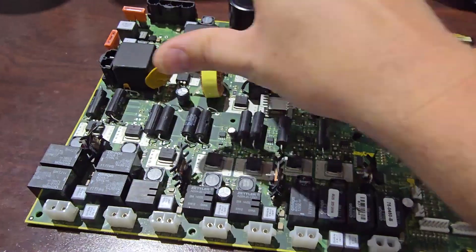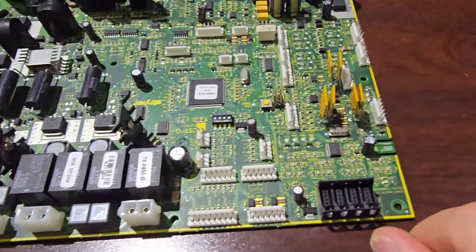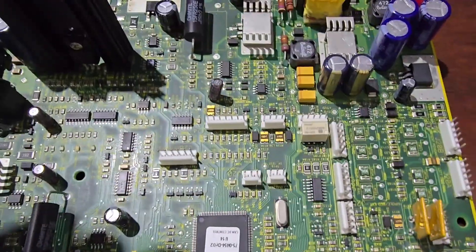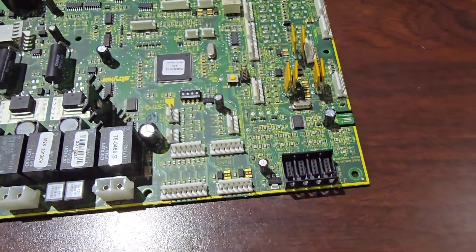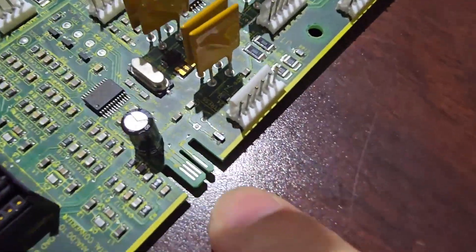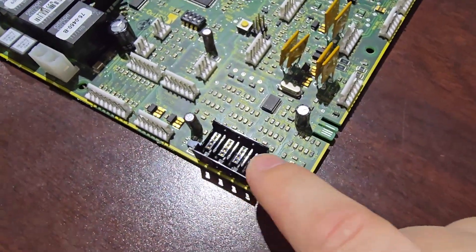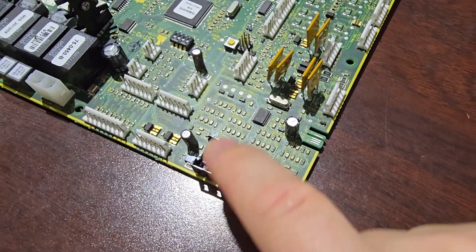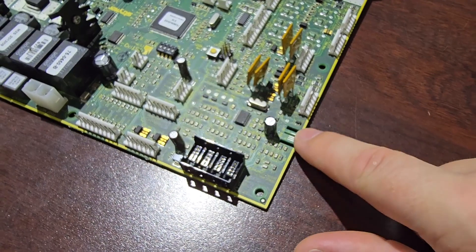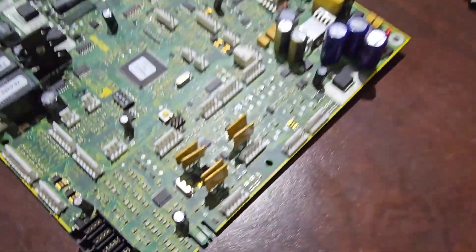It's very easy to test your DC power, very easy to test the legs for your motors. If you have an error code, you have a very nice layout over here. For bed scales, there's not very much you're going to be able to test interestingly, but down here there is an RS232 port — that's probably for output from the scales. I bet this little chip right here is the one that controls the scales, and this component is probably for calibration or some sort of alternate output. Very cool.